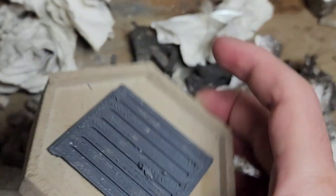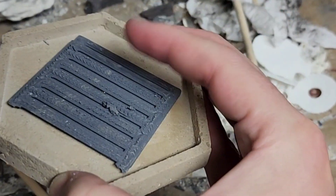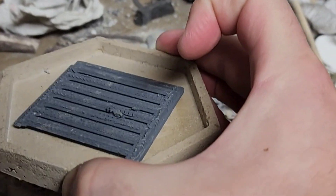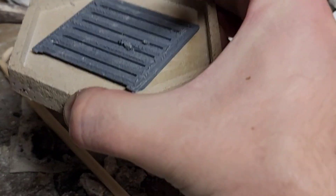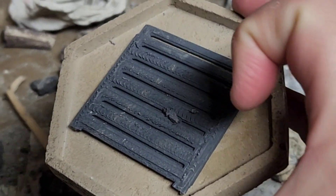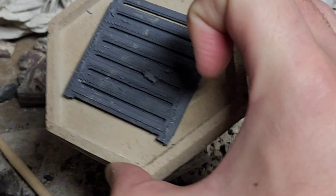Okay, we have another side quest here. I had an extra silicon carbide element. I fixed it with some glue and I'm going to pour some castable refractory around this. The idea is that this would be a plug-and-play heating element, so a regular crucible should work — you'd just pop one of these in at the bottom or the top and that would be the heat collector. Rather than embedding them into the actual crucible itself, this may produce a little better results.